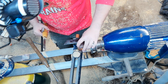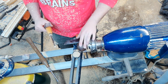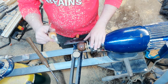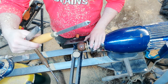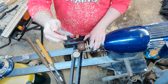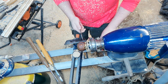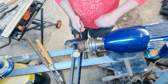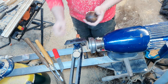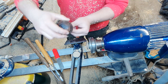We've developed a few cracks in here — they must have been in the wood before I started turning. It's probably not the safest thing to turn if you've got big cracks or splits. Just to make it a little bit safer I'm going to be using a thin parting tool to part it off nice and slowly. Off we come — we've got the bottom. I've done a little concave on the bottom so it's going to sit easier on the legs.